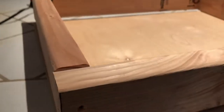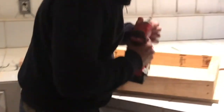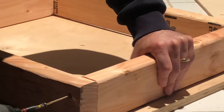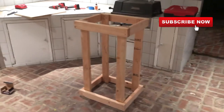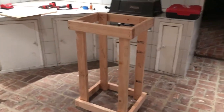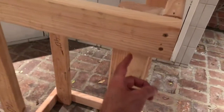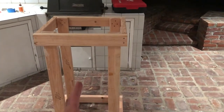Pre-drilled, and applying a little bit of glue for some extra strength. So here is the stand — the main structure. Usually when you have a heavier tank, you like to put guides in here to keep some more pressure. We're going to be applying plywood on top of it, which is going to have that stabilizing effect to keep it from wobbling on the sides or back and forth.